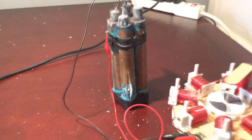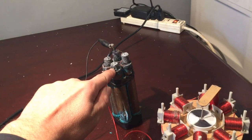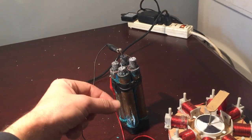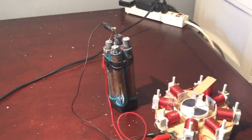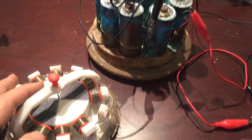There's a lot of internal pressure, and I think that's the key that keeps these things going. The internal crystal growth keeps growing and driving its way into the fresh virgin magnesium. So rather than the magnesium building up a layer of crud or corrosion that would protect it, it's constantly being pressed into by the electrolyte itself and the crystal growth. That's my theory.